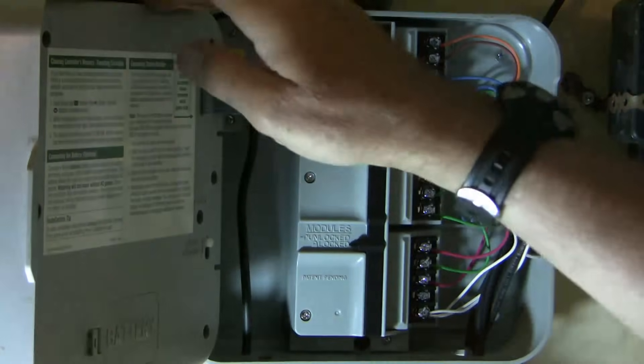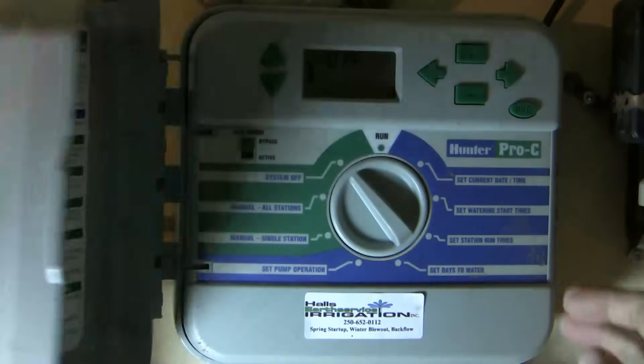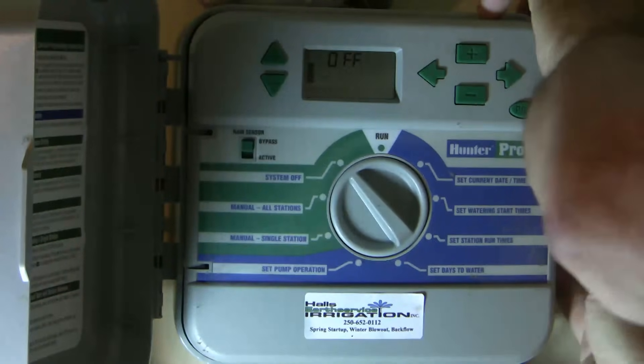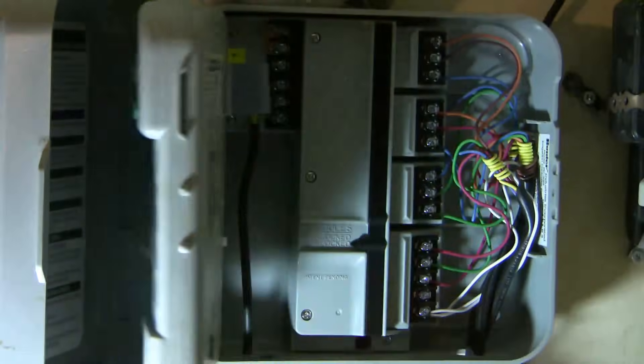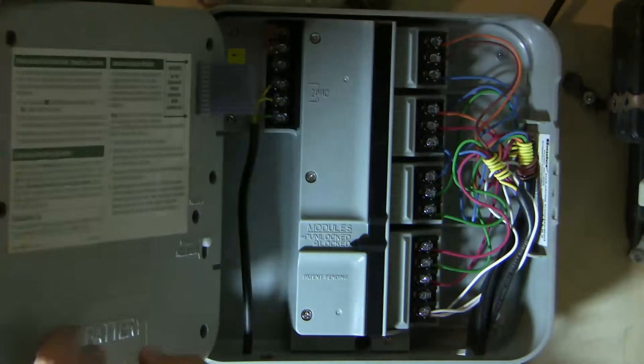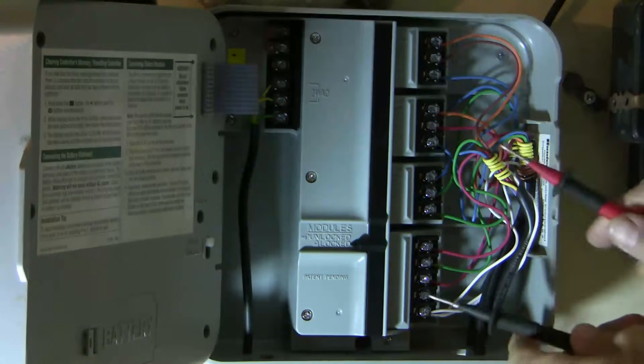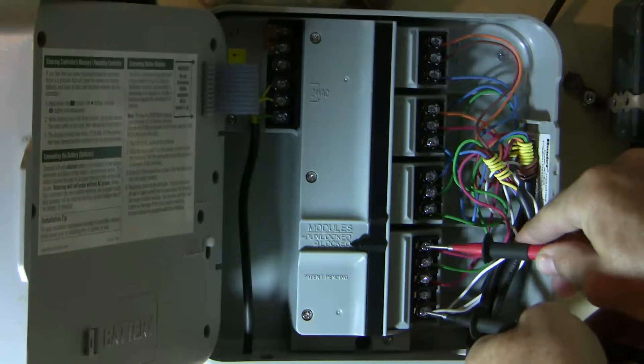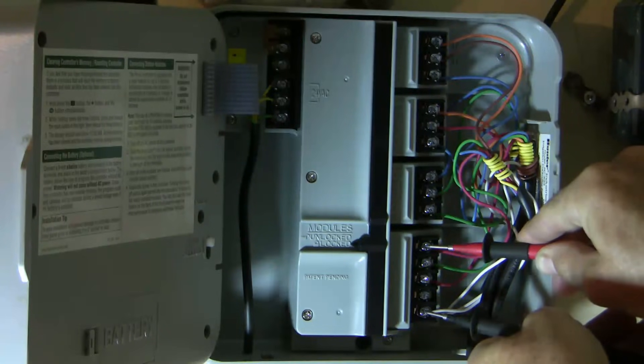One way to quickly screen for faulty wiring or a bad solenoid is to measure resistance of the circuit from the controller. I like this method because it tests the wiring before you remove the wire connectors, possibly destroying evidence. To do this, be absolutely sure there is no power to the circuit in question. Resistance in that circuit should be between 20 and 60 ohms. Too low suggests a short; too high suggests a bad connection at a wire nut or a bad solenoid.